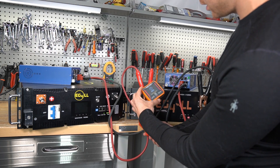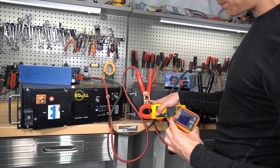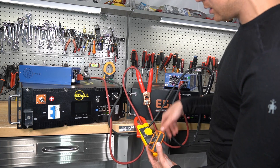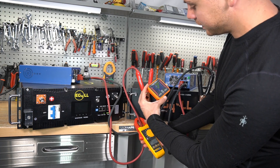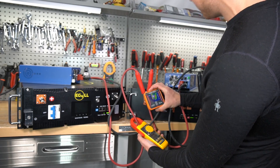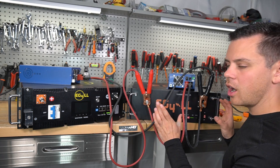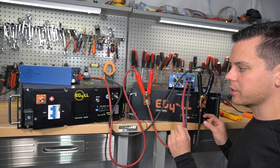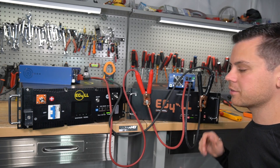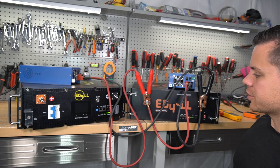The terminal is at 129°F — not that bad. The copper is actually wicking away heat from the terminal, bringing it down to 110°F. I love science. Even with 140 amps going into these batteries, they're so large that this is still a 0.35C rate, so it's pretty safe. But they still recommend only 100 amps. We'll come back in about an hour when it should be fully charged.